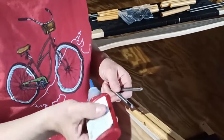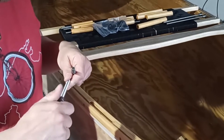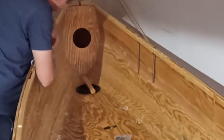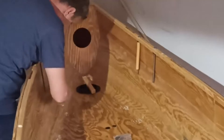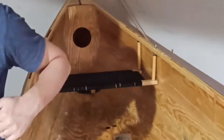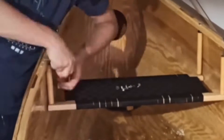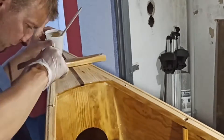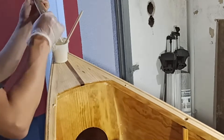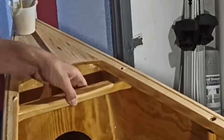After that I could mount the seats. For this I used threaded rods, wooden pipes, nuts, and rubber washers between each layer. This way the seats can later be demounted rather easily. All handles and thwarts were mounted the same way. I decided to mortise them for optical and weight reasons. I mixed thicker epoxy than usual and trimmed the overstanding dowels with a Japanese pull saw.